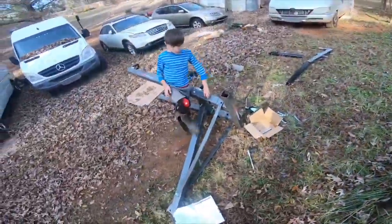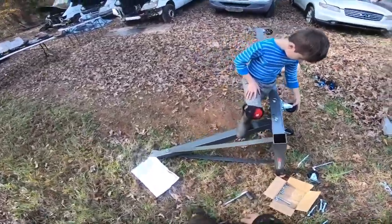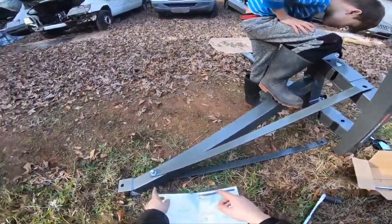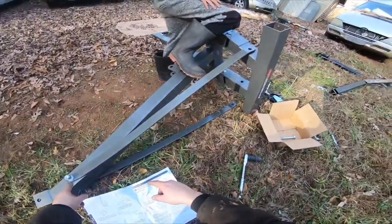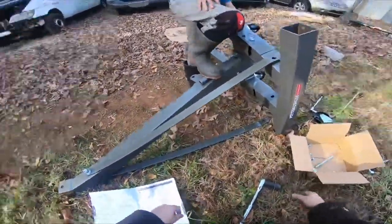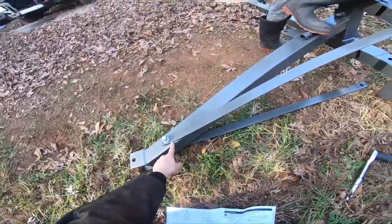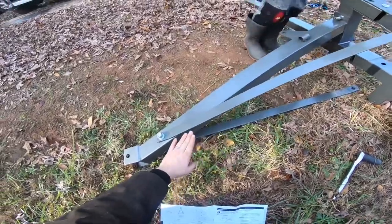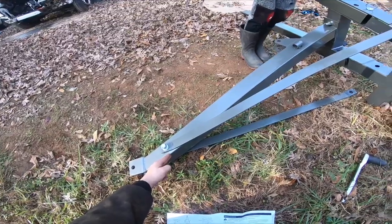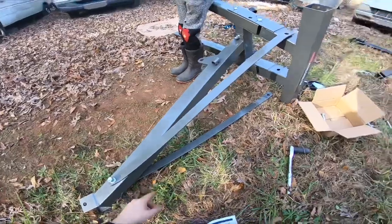Hey guys, we already installed 4 wheels. We're gonna be installing these wheels, but we decided to actually go ahead and install a couple of these bars. Now, I will give you a word of recommendation. First of all, you're gonna use size 9 bolts. It's gonna have like 9 stickers, so it's a part 9, that's what it means. So I recommend installing it like this, where the flat piece is this way and that's going that way. This is obvious, but install this portion first, because you're gonna have 2 pieces coming together, and if you install that other side first, it is not gonna be the proper angle for you to put that bolt in.